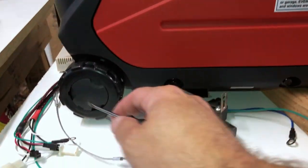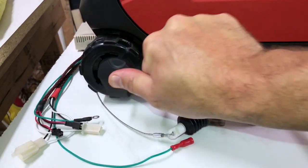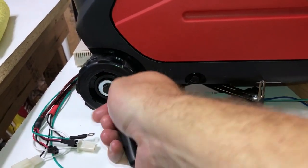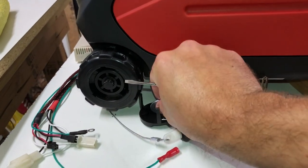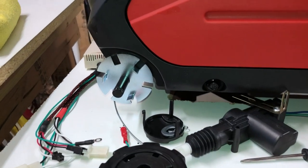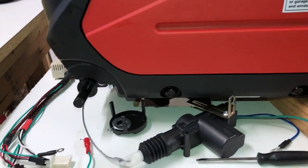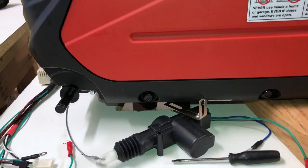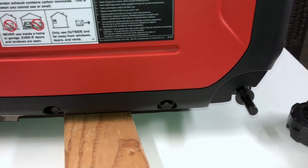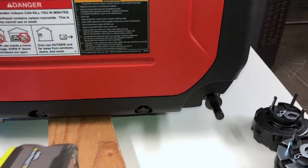Same thing on the front. That's the washer. You see that plate — that's the brake, so that just slides out very easy. Put those over with the other wheels and we're good to go. Next we see these three bolts here — they are our trusty 10 millimeter bolts, so I'm going to use a drill.